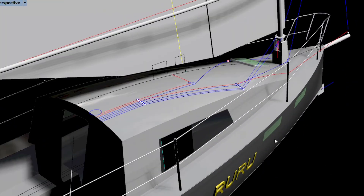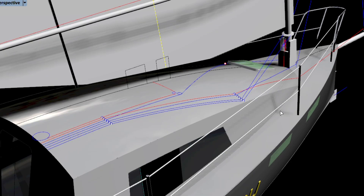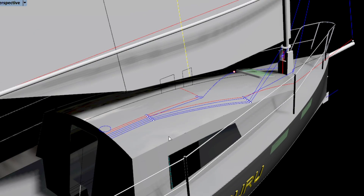This is the rendered version of this drawing - it's not finished by any means, it's a work in progress. The lifelines, for example, will be a single line except for one line really close to the deck which will act as a toe rail. This is a yacht where you don't have to go up on the bow much, but there'll be handrails here - got some stainless bits on the way for those feet. I'm still thinking about how any of these fittings that go through the deck - how to make them fairly flush fitting on the inside, because the proximity to your head will be a bit concerning. You'll know about it if you knock your head against a dome nut. So I'm off to the boat to do some hole drilling and filling up of those holes with thickened epoxy resin with glue filler in it.